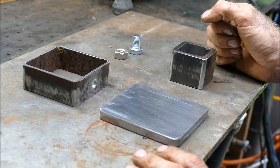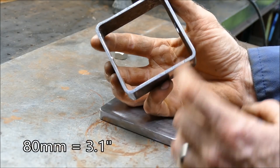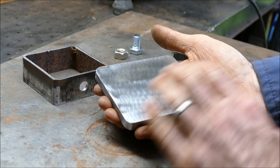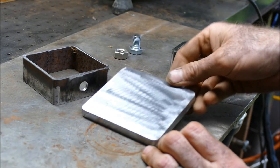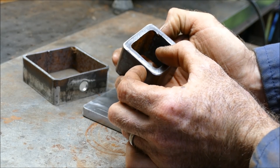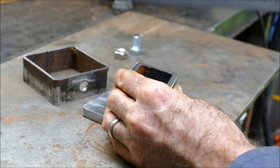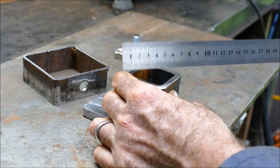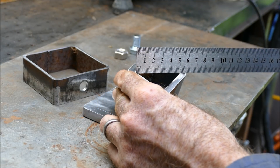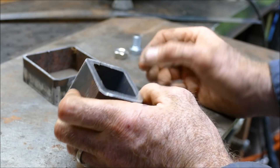The first tool I'm going to make is the tool holder. It's a piece of 80mm box section - the same stuff I made the main posts for the power hammer out of - and I've got some 10mm plate to act as the flat bottom for holding different shapes of tools. Then this part is 50mm box with a nice thick 6mm wall thickness. I intend to slide other pieces of steel diagonally across it that are 50mm long, and the cross section between the two corners is exactly 50mm. Let me weld this together and I'll show you how I'll use it.